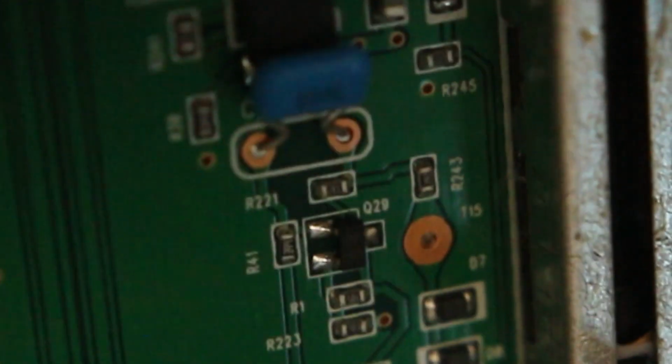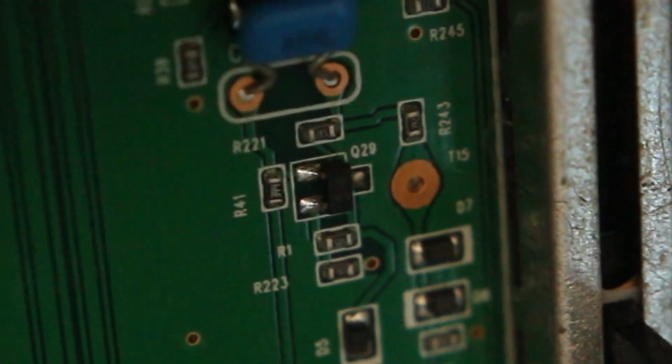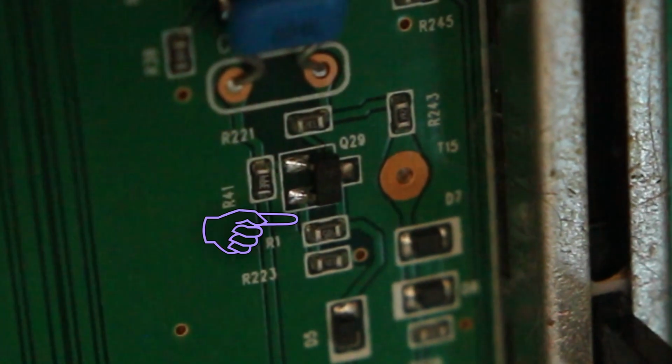That's our transistor, and it's got a leg that immediately goes off to a tiny resistor, and that's the trace we need to cut. I'll point an arrow or something. Maybe I'll circle it in my footage, or if I need to use somebody else's photos, I will. And once you separate those two, then your LFO is free running.